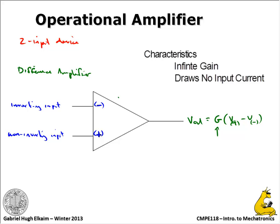All right, so we were talking about the fact that a standard vanilla cheapo op amp that you can get for $1 has a gain of approximately 10,000, 100,000 around there. So quite big, which means that we never use it like this, as an open-ended thing, because it will sit on either one rail or the other.